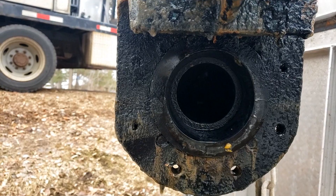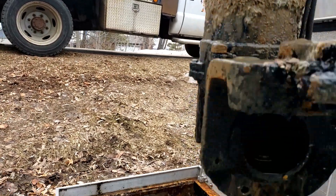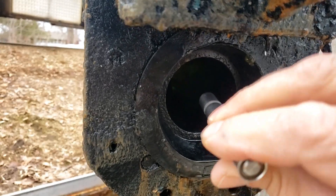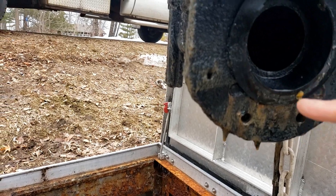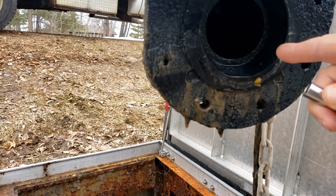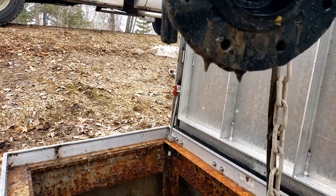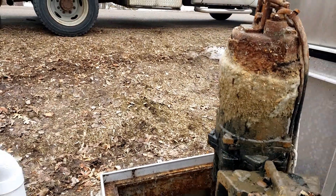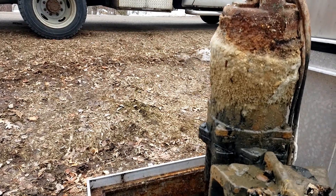It's hard to see in there but there's an impeller in there. I'll get a flashlight on it — yeah, there's nothing in there now, it's nice and clean. I pulled it all out. This is the base elbow, and this sits down on an elbow like elbow macaroni. This rubber seals the pump up so it can remain in contact, and the lift station takes the water from down low and pumps it up high.